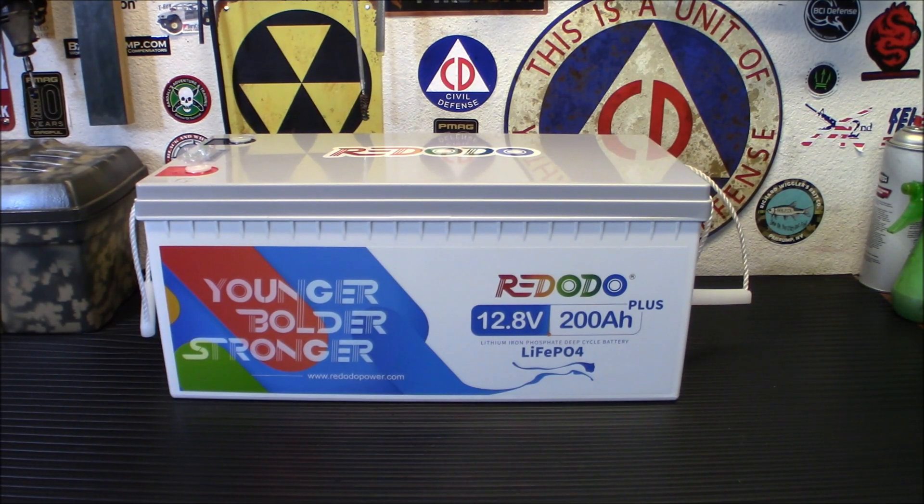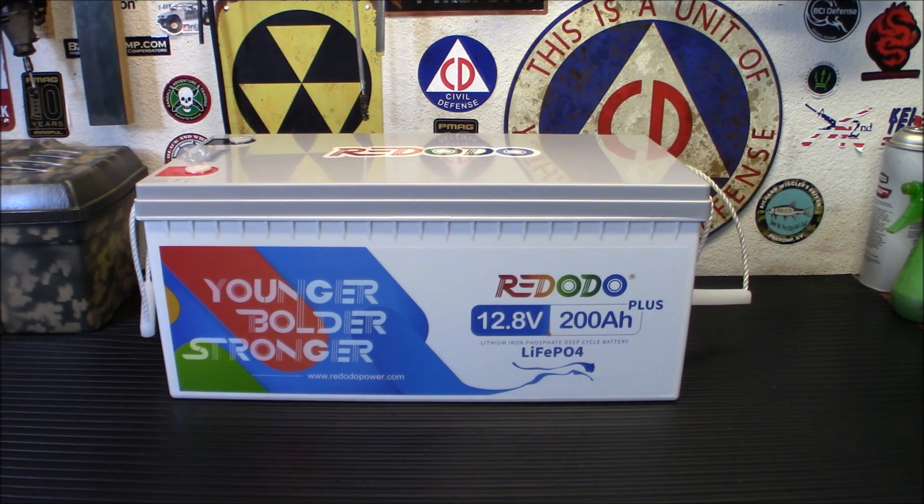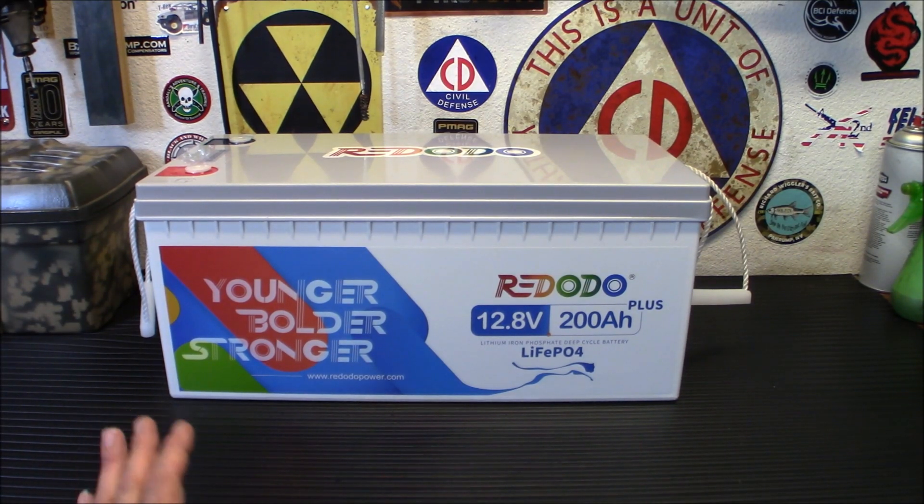These also have a very deep discharge capacity. The battery management system inside protects them from being completely depleted. They can be fully discharged without affecting the delivered capacity — that's another benefit over lead acid batteries. If you've ever killed a lead acid battery, you know you're going to need to replace it. You don't want to run deep cycle lead acids down past a certain rate. LiFePO4 batteries can be deep discharged without being ruined, and the increased storage capacity gives you a whole lot more before reaching that discharge point.